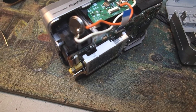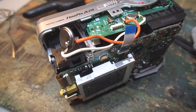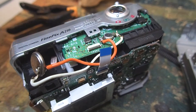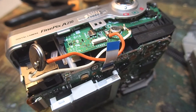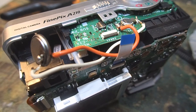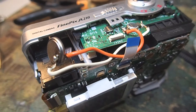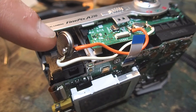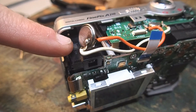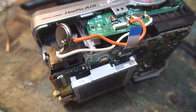What I did here is I soldered a CR1220 battery directly to a set of wires and paralleled it with the original battery that was on the auxiliary power supply board up here. There's really not enough room, and I didn't feel like trying to buy something special. I feel I can probably tuck this battery right underneath the top — there's a little bit of space here. So we're going to give that a shot, reassemble this, and see if it works.